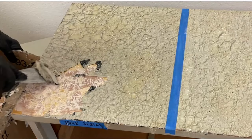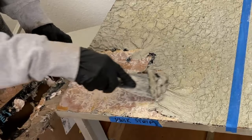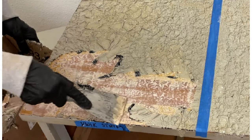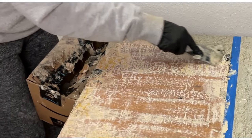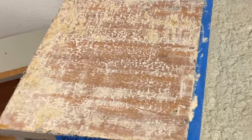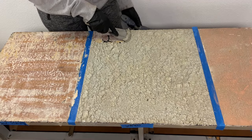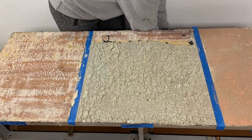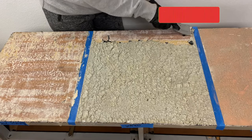The company recommended use of a plastic device to keep from scratching the wood, but I used a flexible metal putty knife and did not see any damage to the wood. As you can see, removal of the stripper is really messy. I was able to remove the stripper easily and discarded it in a paper box. Next, I removed the Watco stripper from the second section. The old paint and finish came off easily, so the bare wood was exposed. The amount of effort required to remove the Watco was about the same as the effort required with the Quickstrip.